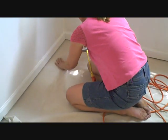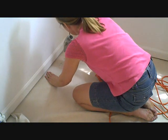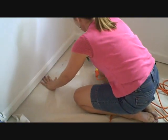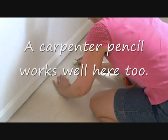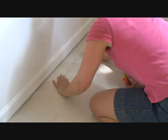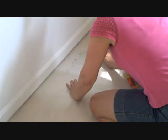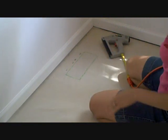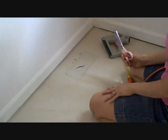Right here I have a vent, so what I'm going to do is lightly stretch around it. I'm going to take a magic marker and trace what I can see of the vent right here, and I'm actually going to come in with scissors and cut this part out. I'm just going kind of by feel so that I can find this. I'll take scissors and cut out right on my lines, and I'm not really worried about fraying because when I get the polyurethane on here it's going to block it from fraying.